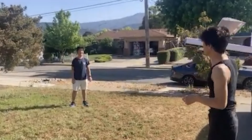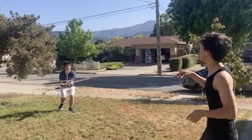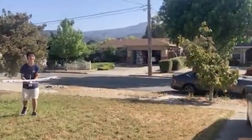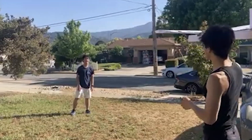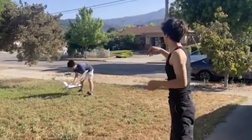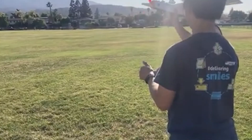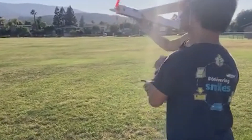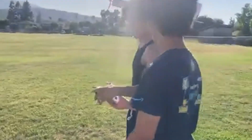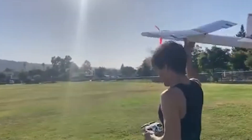After testing the electronics, I was almost ready for flight. I did some test throws with my friends to see if the aircraft was stable — preferably, when thrown, the aircraft would glide smoothly in a straight line. The throw test showed me that the plane was a bit nose heavy, but that was alright with me. It was still controllable, whereas a tail-heavy plane would run into much more serious problems. We flew the plane, and though our first flight didn't end well, the second one was smooth. We did not bring spare props though, and the props snapped on landing, which prevented us from having another flight.